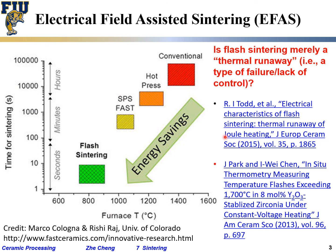Make sense? Yeah. For this type of sample, the higher the temperature, the lower the resistivity, the higher the conductivity. But the higher the conductivity means the smaller the resistance through the sample. And then from what we learned in high school physics, U squared divided by R. Because quite often people do this under so-called constant voltage mode, initially at least. Remember what we showed of Dr. Raj's group, 100 volts per centimeter. He was applying a constant voltage. So in that sense, constant voltage squared divided by resistance. Of course, you have higher and higher power as the temperature rises, and it becomes so-called self-accelerating. Okay?